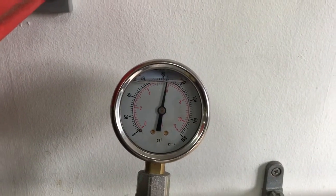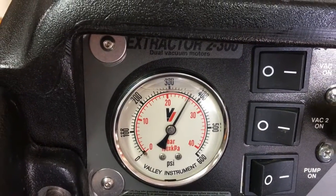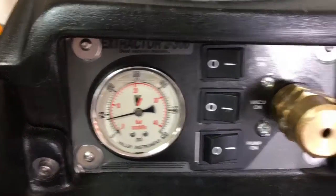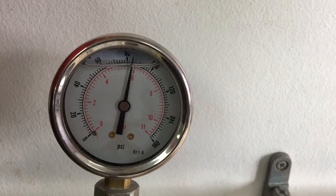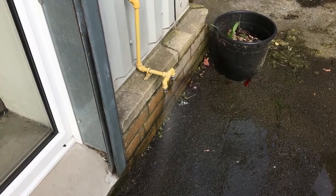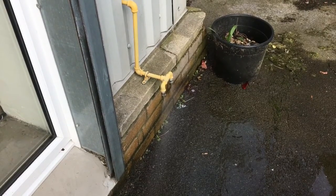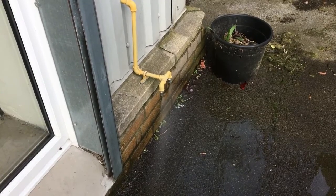I'll shut and open the valve again. As I close the valve there's no flow — it comes back up to 350 PSI. As soon as I open the valve, pressure drops again and we're delivering again 84 PSI at the tool end. If we go outside we can see the jets. So in a real-time situation, if you're on a job with your machine ramped right up to 350 PSI, once you've opened the flow you'll be delivering 84 PSI out of your twin jet wand onto the carpet.